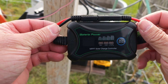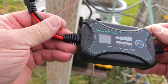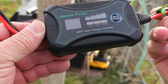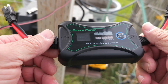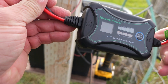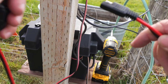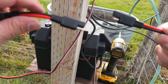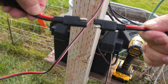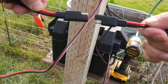Here's our new charge controller right from the packaging. On the face there's a little picture of a battery and a little picture of sunshine, so one side goes to the battery and the other side goes to the solar panel — that makes it really difficult to screw up. The most important thing during installation is making sure our polarities are correct. Here I have the cable that goes to the solar panel. I'll line it up as if I'm going to plug it in and make sure red is going to red and black is going to black — and in this case that's correct, so let's go ahead and plug that in.